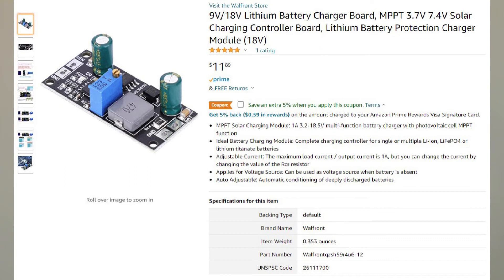Of course, using two 18650 batteries in series will double the output voltage, which solves one problem but creates a different one. The CN3791 battery charger has a maximum output of only 4.2 volts, but two 18650 batteries in series needs a charging voltage of 8.4 volts. Fortunately, there is an easy solution — another integrated circuit from the same company that makes the CN3791. It can easily handle two 18650 batteries in series. It's the CN3795. Here's a PCB using that IC at a reasonable price, so I ordered one of those.